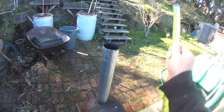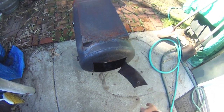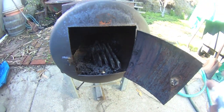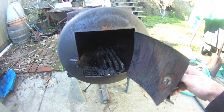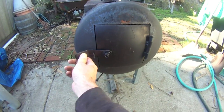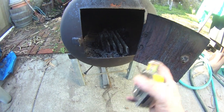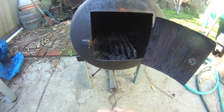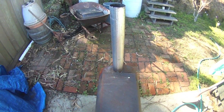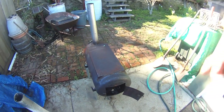This stack is too small — it's a piece of exhaust pipe, three inch OD, and it really smokes a lot. That's the first thing. The second thing is that this inch and a half hole on the bottom is not enough air intake. If I close the door and try to burn it, it really chokes it out. You can tell by the paint — this part is nice and clean, but this paint is obviously taking heat. I may not change the door, since I don't mind having it open for active burns, but I have to change this stack because it creates so much smoke — it's like running it with the damper mostly closed.